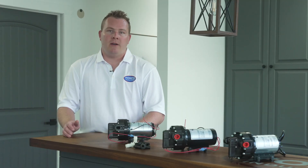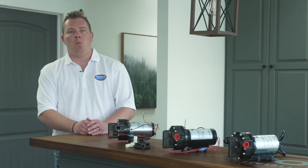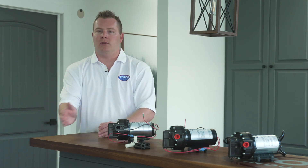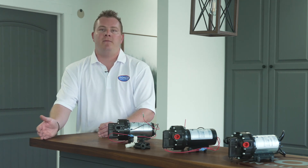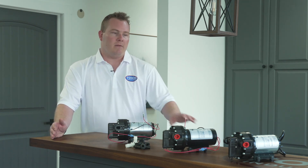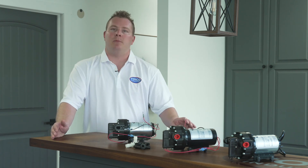In either pump we have what's called a variable speed pump. Think of it as if you have a restroom trailer with multiple sinks. If you have one sink running at four and a half gallons per minute and someone next to you turns on another sink, rather than the flow dying down, the variable speed pump will speed up so it keeps the pressure consistent.